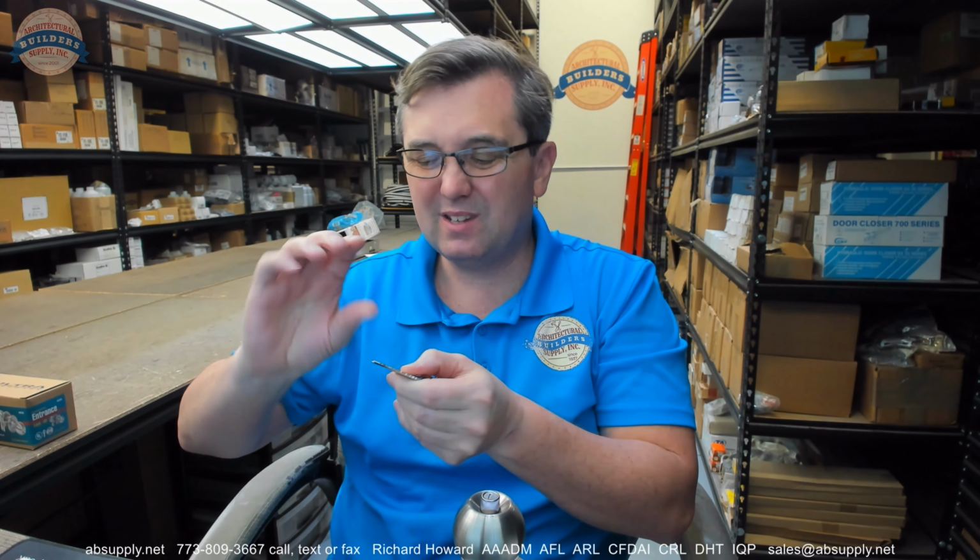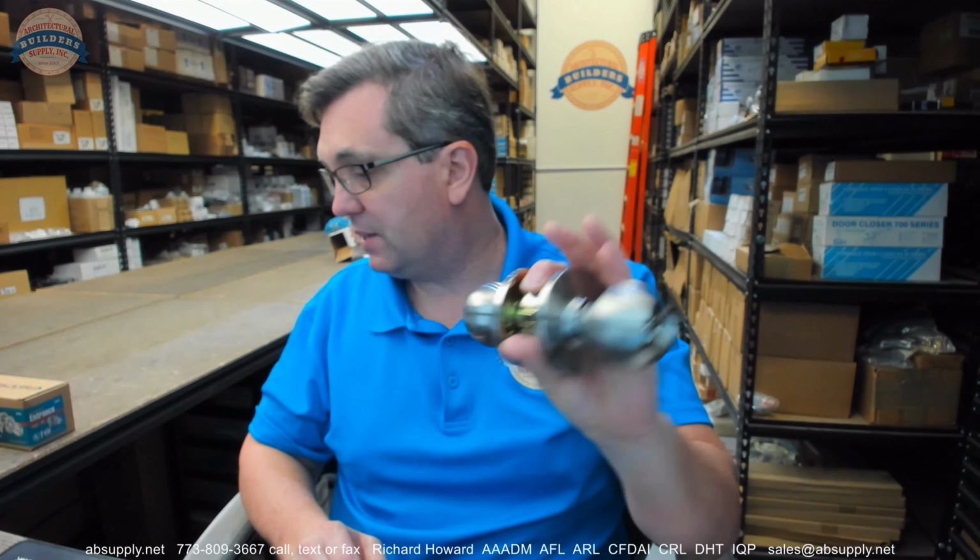I've not tried a third party or an OEM manufacturer like Kaba Ilco or others. And generally, while it's not considered best practice, I have in the past taken my file and just taken a few passes off each side, thinning the blank ever so slightly. You're dealing with non-original equipment made to an original manufacturer's specifications, but they're not going to be exact, is the bottom line. And that's why this is an inexpensive lock. So you get the 2 keys.